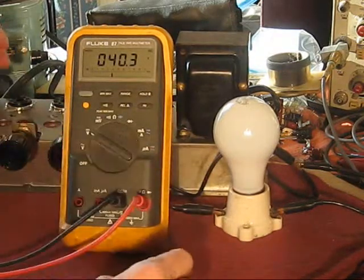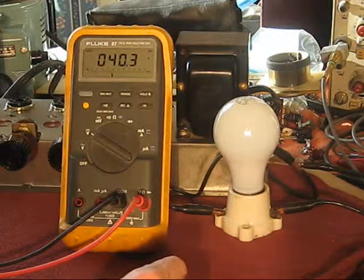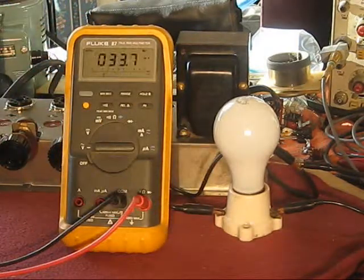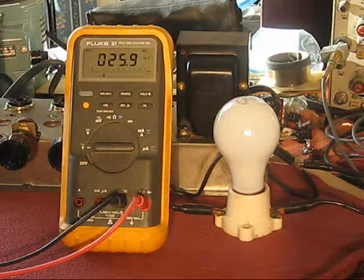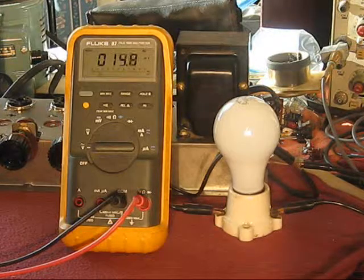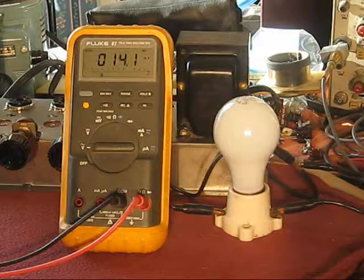Another thing you can look at is what's the AC voltage across it right now? At 40 volts DC across it, well, this thing's meant to filter ripple. Is it doing it? Is it open? What's the AC voltage across it? Let that settle. I'm seeing it going about from 16 to maybe 20. Oh, there's a 30 millivolts of AC ripple.